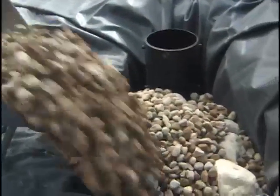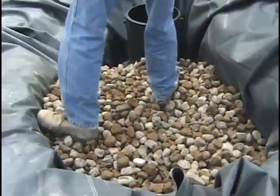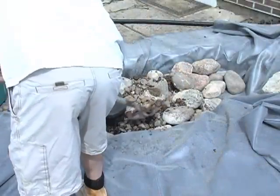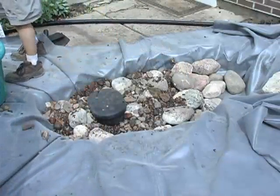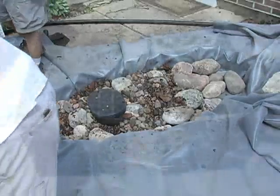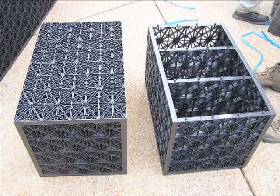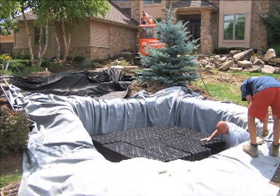Next, we pour the larger gravel on top and spread it evenly throughout the basin. After spreading the larger gravel, we pour a layer of smaller gravel on top. This layer should completely fill the basin, just over the area you've designated as maximum water level. The water matrix are available as an alternative option to natural stone when building large pondless basins with the full-size Snorkel and Centipede.